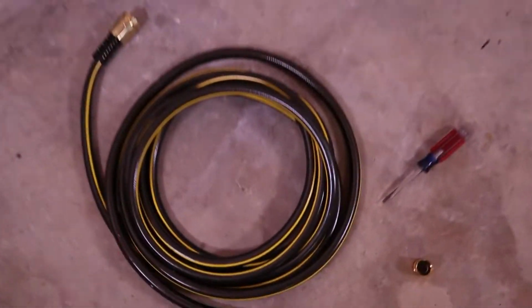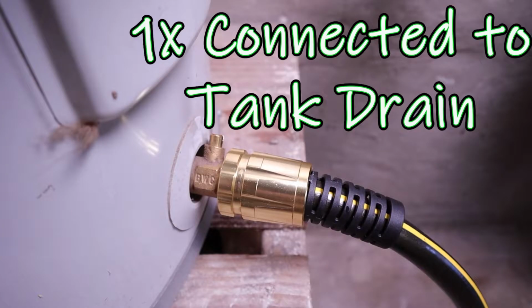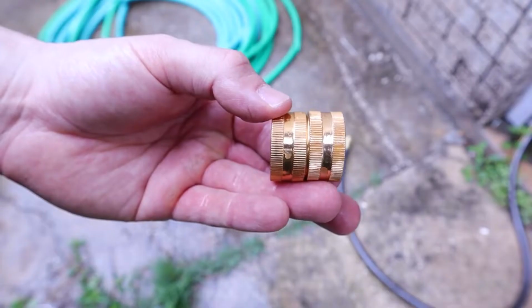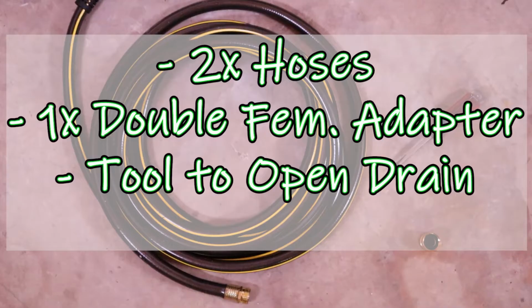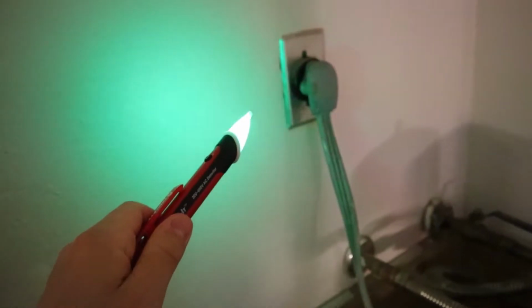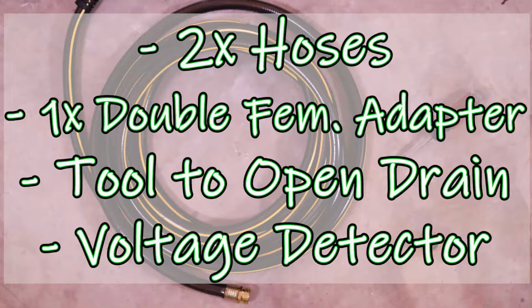The tools I needed for this job were a couple of garden hoses, one to help with draining, one to help with backflushing. I needed a male-to-male adapter to also help with the backflushing. I needed a tool to open my drain valve. In my case, it's a flathead screwdriver. Yours may be different, check your owner's manual. And I also needed a voltage detector to help identify the right breaker to turn off my water heater properly.